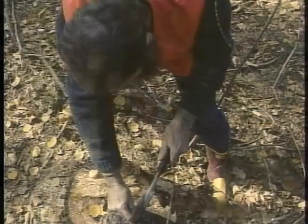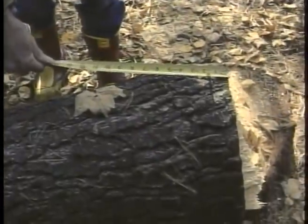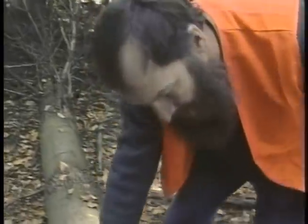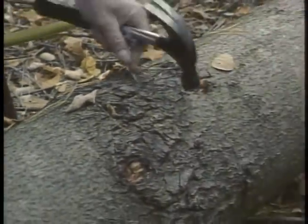This log here has been angle cut for felling, so our beam's not going to start here — it's going to start back here somewhere. We're going to lose about seven inches, so we've got to add that when we're done. Let's see where 18 feet takes us. Here's 18 feet. There's seven inches for the shave off at the butt. We need about 12 more, but I don't want to work here if I don't have to. So we're going to cut it right about there and call that 18 feet.